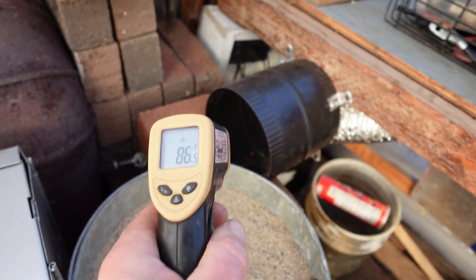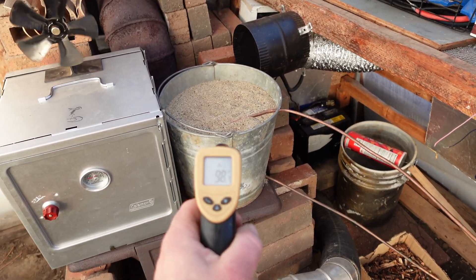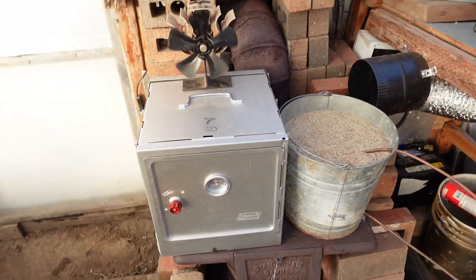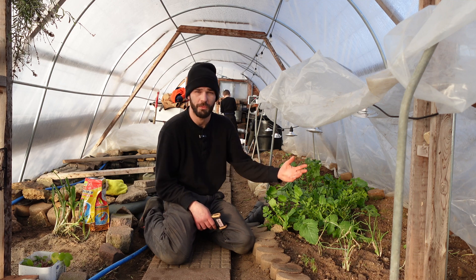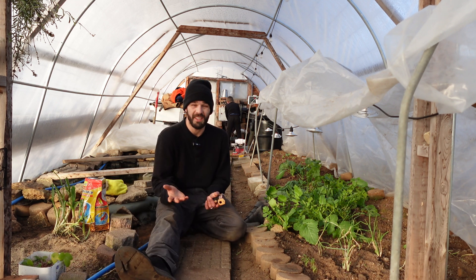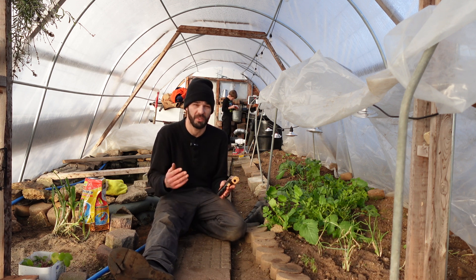We brought the temperature down. I can see a little piece of dust flopping in the wind because it's really drawing some heat from there. Everything is pretty warm right here, but the outer side sand takes so long to heat up. We're probably at about 40 minutes since initial startup. Our geothermal even in summer produces between 50 and 60 degrees — 62 was the highest we ever saw with over 100 degrees in here — so it really does work and it works quite efficiently, especially running off solar power. If we've got 50 to 60 degree average soil temps overnight, we might see a degree or two of improvement, and that would be super significant.